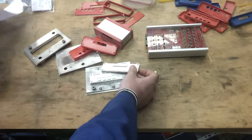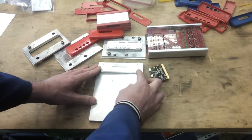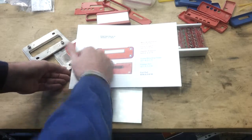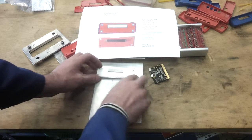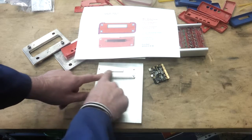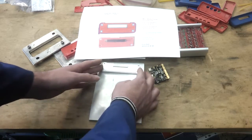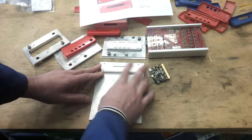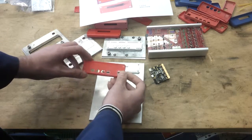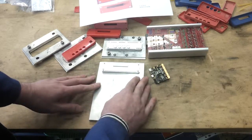So what I've got to do is make a new insert. I just happen to have a piece of aluminium left over from last year. Here's the sketch — it's relatively straightforward: pocketing the main body section down 1.5mm, going around the edges leaving the upstanding pins for the screws, and this bit here needs to be extended slightly. We're going to machine that out and then throw it in the molding machine. I need to remember what material I was using because I think it was actually a blend — some materials shrink more than others so I had to play around with the blend just to get the right shrinkage so that it fitted.